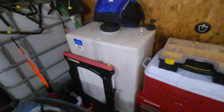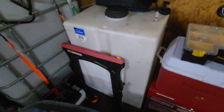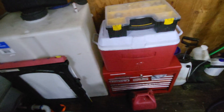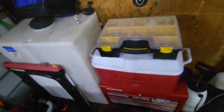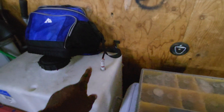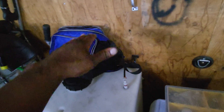We've got a trash can for trash. This rig doesn't do any soft washing — we have another rig for that. This rig has an 80-gallon chem tank that I haven't plumbed up yet because I haven't needed it. If I ever do soft washing on this rig, I already have another pump, reel, and everything ready. I'd add a 7-gallon Fat Boy pump, build a stand from the ground up, mount the tank, and put an electric reel on top.